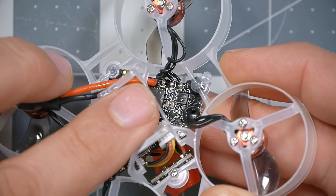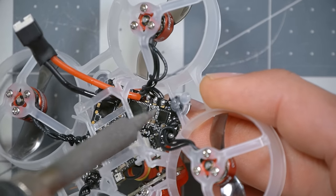What if I needed to solder on a new motor to this board? Would I have to remove the conformal coating first? Great news — you don't. You can just take a hot soldering iron and literally desolder the joint as if the conformal coating wasn't even there. It will melt and burn away without hurting anything. And then when you're done completing the joint, just dab a little bit more conformal coating on to cover it back up. If you ever do need to remove conformal coating, isopropyl alcohol is one way — just go in there with a Q-tip and wipe it off.